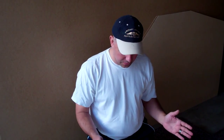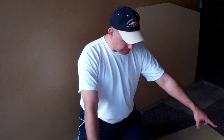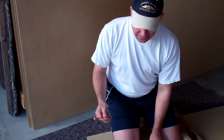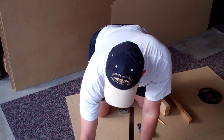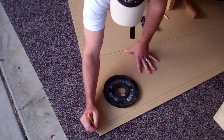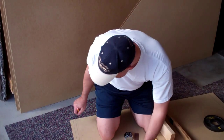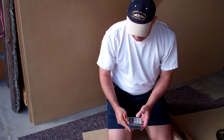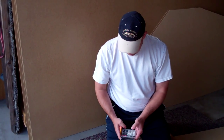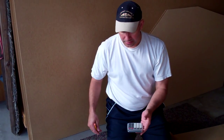Back to something I talked about in earlier videos: spacing your screws properly. I'll review that quickly. Now that I've got all my lines marked out where the screw heads need to go, I'm going to take a total measurement. Let's say, for example, this measurement up here is 36 inches from one end to the other — it's actually longer, so you'll need to consult your Blueprints and Builder Manual. Basically, where these two lines intersect, I'd make a screw there, then come in ¾ of an inch and make a screw hole there as well. So let's say the distance between the outer edges is 36 inches, but I'm coming in ¾ inch on each side. So 36 minus 1.5 inches — because 0.75 and 0.75 equals 1.5 — so I'm automatically cutting that off.